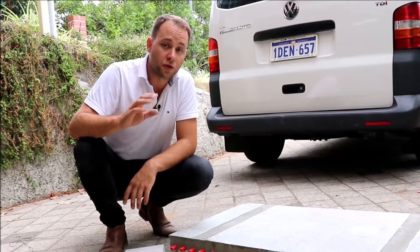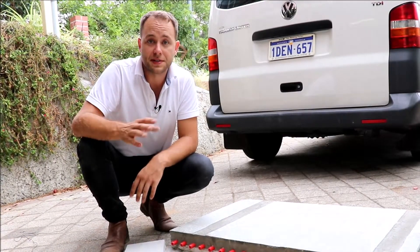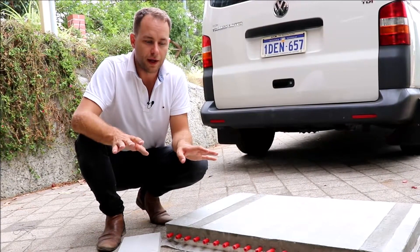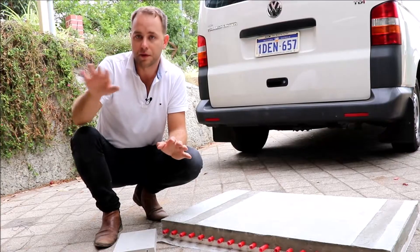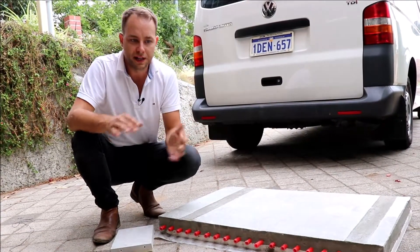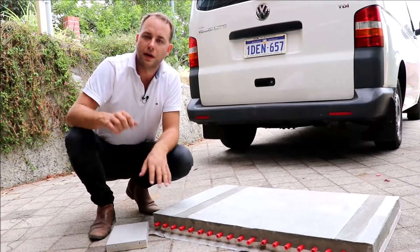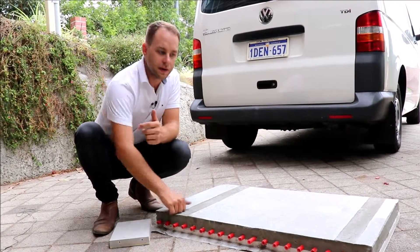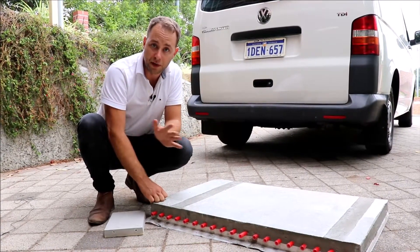There are a few tricks to putting together a good screed. One of them is that you have to have a really well-prepared subsurface or substructure. Imperfections, waves, or any sort of unevenness can lead to gaps between the insulation and the substructure, and this is one of the causes of drumming — when you hear something drum. A well-installed screed will never drum, ever.